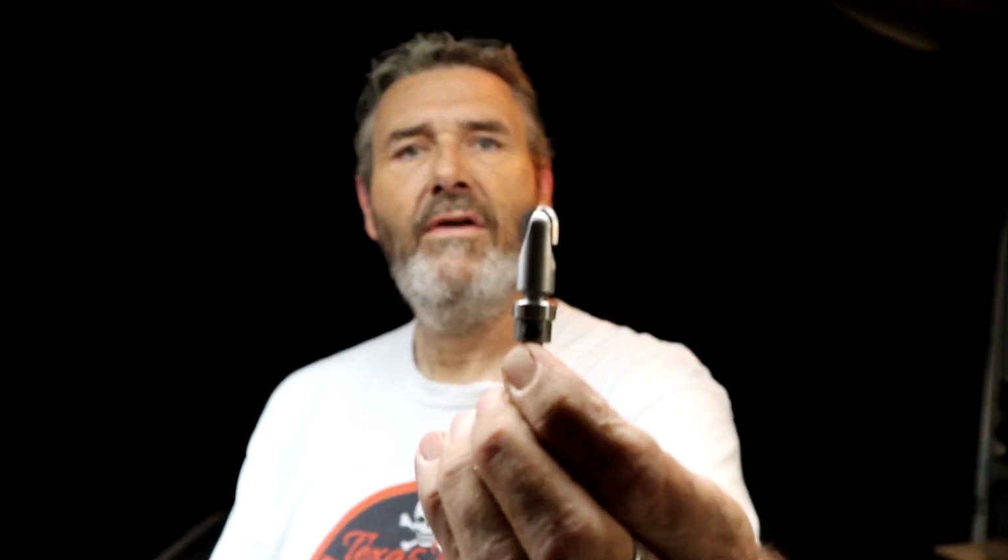What I'm thinking about doing is cutting a relief right back in this area. And I've made a template, and I'm going to film a whole series eventually just on template making. But for now, I drew out a shape on this piece of 1/2" MDF, and I worked on this with the spindle sander and got it to where it was nice and fluid, and there were no sharp or flat spots in it or anything like that. This is a round end. It's just a cove bit. I've put a bearing on there.